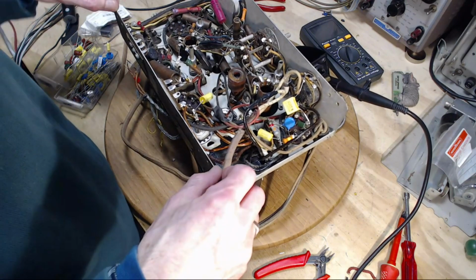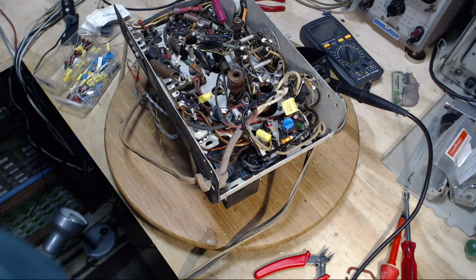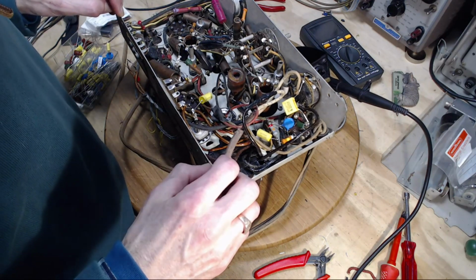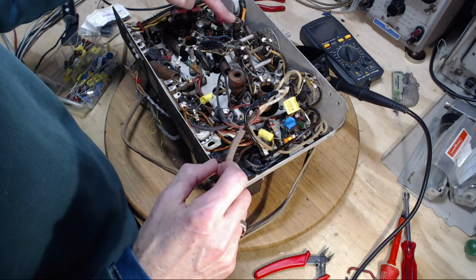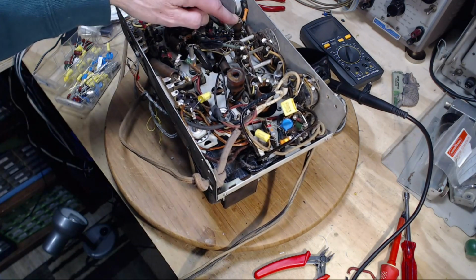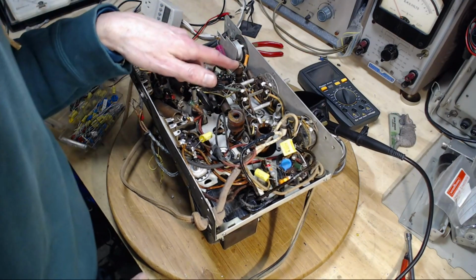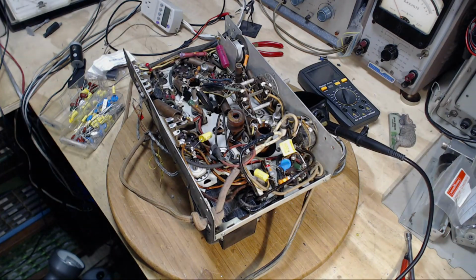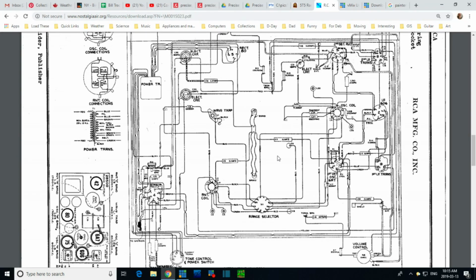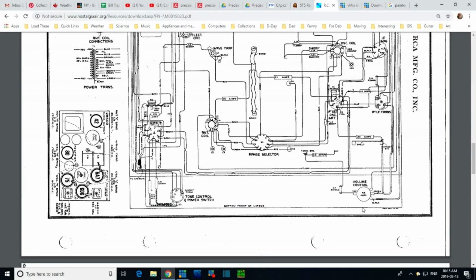Okay, now another potential audio capacitor. This one. Let's take a look at this one on the schematic here. It's right off the back tab through a resistor here down to the chassis. That should be easy to spot. So we can look on here and try to spot it. So it's by the volume control. There's the volume control. There's the back tab.